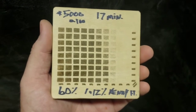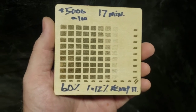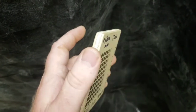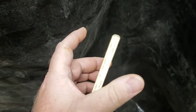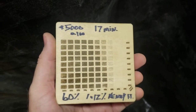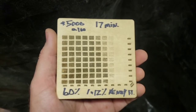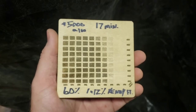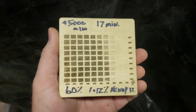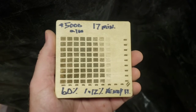This here is set at 60% power with one coat of the 12% dilution of the Kenny Hack. As you can see, it only slightly stained — here's the natural white color. One coat brushed on, wipe off the excess, blow dry it for 30 seconds to a minute until it's good and dry. You'll kind of see the wood transition as the solution cures the wood. This wood just kind of stains a light tan.